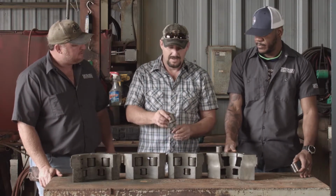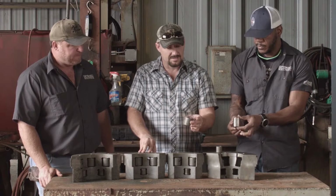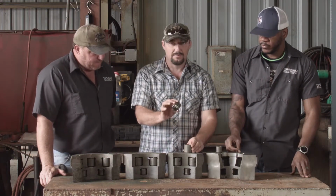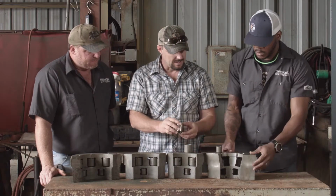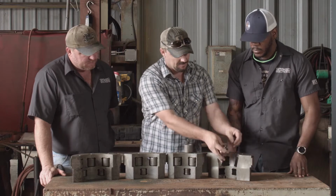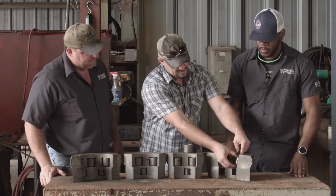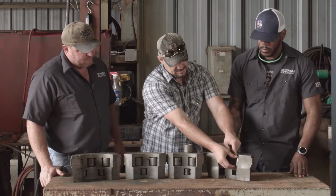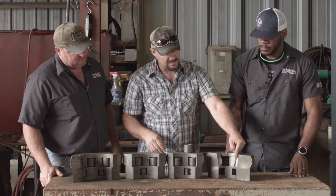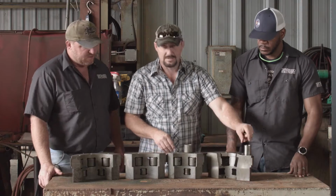Again, this is a standard roller for a collar connection. And then we have a different style roller for our beveled connections, which is this insert here, our beveled insert. The rollers, of course, go in there, and this angle matches the angle on the connection, whichever angle is required.